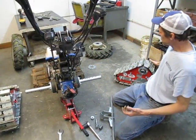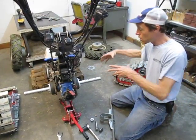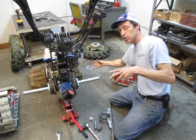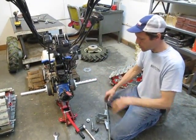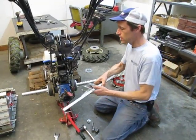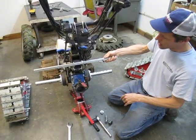When you've got a track mounted to a single axle like this — unlike a bulldozer that has two sprockets actually attached to the frame — you've just got one axle point, so you've got to have some kind of location system that's very rigid and not going to move. That's what this brace bar assembly is going to be once we get it all assembled.